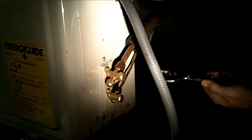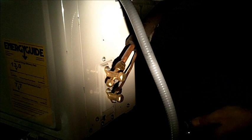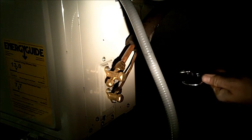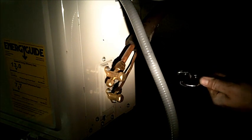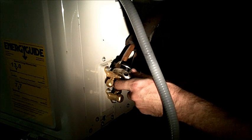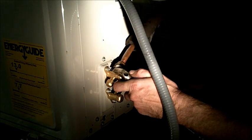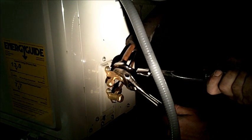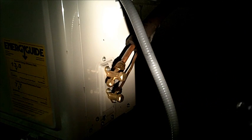These machines are great machines, but installed improperly or tightened with the wrong wrenches will cause you nothing but a headache. So we want to make sure this step is completely followed through. If you don't have a torque wrench, it's not very expensive — we use a set made by CPS, not more than about a hundred and a half dollars. I'll show you how we do the large fitting. Once it clicks, that's tight enough. Always use a backup wrench — if you don't, you can ruin the fitting. Use a backup wrench, put your torques on it, and you should be in good shape.